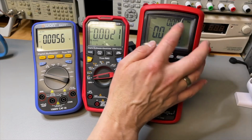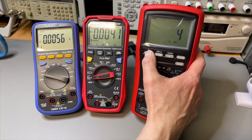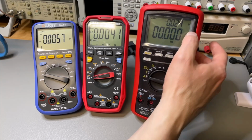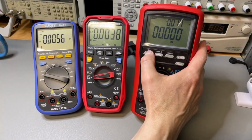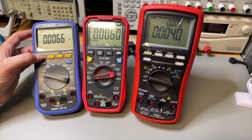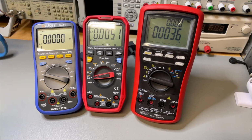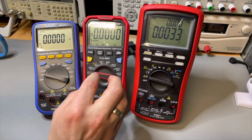the nice thing is it shows the frequency and the voltage at the same time, and we can change also. Then you see it in dBm, also with the frequency, and you change it again, then you have the voltage and the frequency the other way around. So some nice options there. And then we check the DC function. Well, in the Owon you just switch it over to DC, and that's it. Here you can switch it over, but then they have some extra options here.